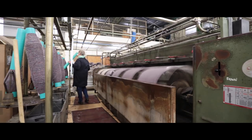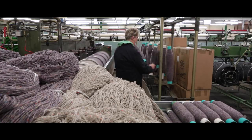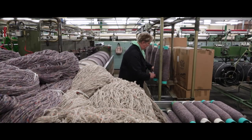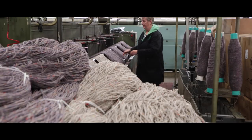There is another process which involves washing the yarn. This is where the customer requires the yarn to be washed, which is mainly the oil being taken out of the yarn, so they can knit their garments and the finished item doesn't need to be washed afterwards. The yarn after spinning is taken to a machine called a hanker, which makes small oval-like shapes in order to work through the scouring bath.